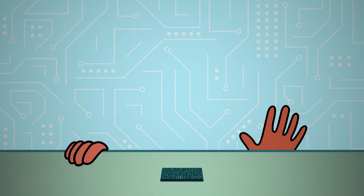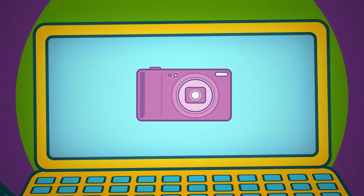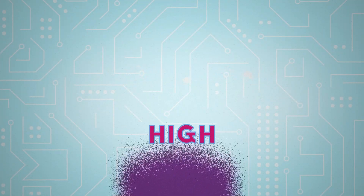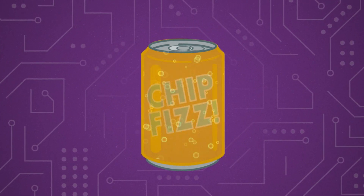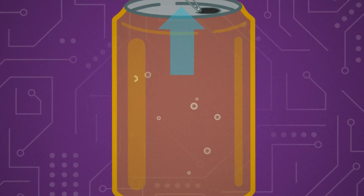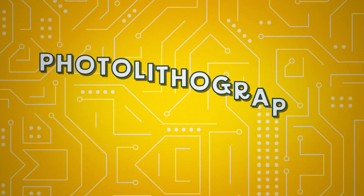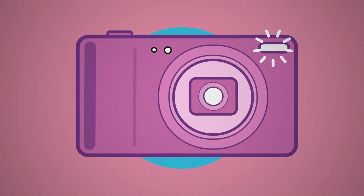Building microelectronic devices like transistors on a microchip allows us to change what the microchip can do. Some chips do calculations, others store data, but each device is made a little differently. Since pure silicon has set properties when it comes to conductivity, they need to introduce other materials to alter it to get the desired effect. Diffusion is where molecules move from a high concentration to low concentration. One example is how sodas go flat after being open — caused by carbon dioxide diffusing into the relatively low concentration of carbon dioxide in the air. With microchips, we can expose a semiconductor like silicon to gas or liquid containing other elements to chemically alter the composition of the wafer. Combined with other approaches like photolithography and etching, engineers can build different kinds of devices. This is just one of the tools we use to design and manufacture microchips that can power our world.